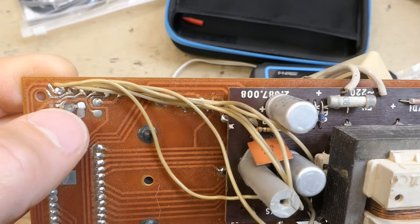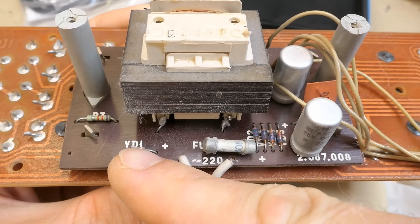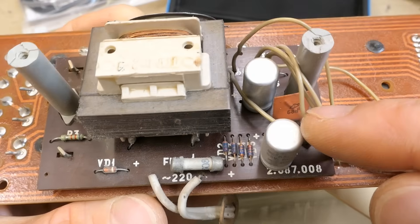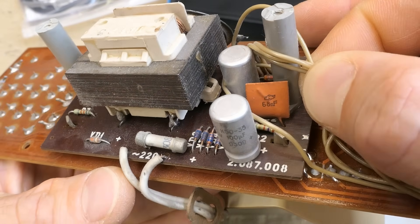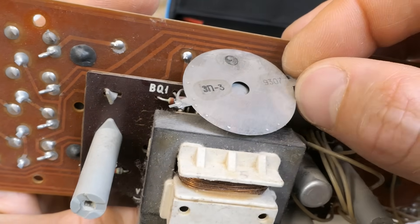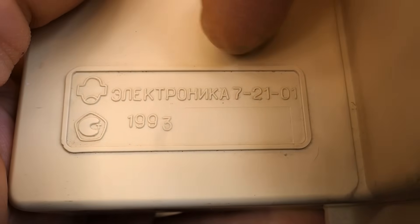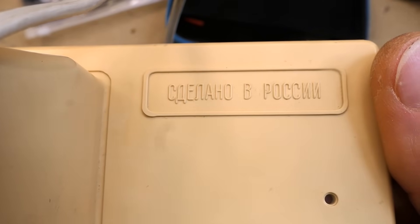There is a tiny adjustment capacitor. The power supply board seems to have two zeners, some resistors, a bridge rectifier made of discrete diodes, two electrolytic capacitors, one ceramic capacitor here — 68 nano — and a beeper for the alarm. This one is actually made in 1993, type Electronica 72101, and it says made in Russia — no longer made in USSR, so it's quite late.